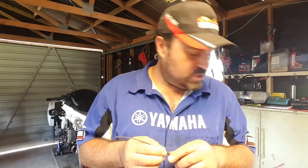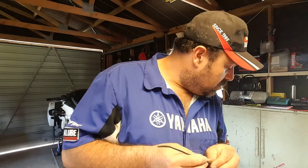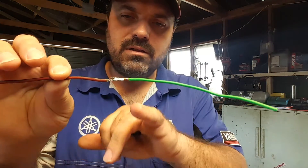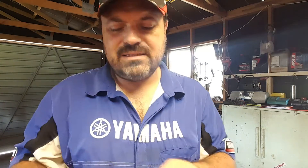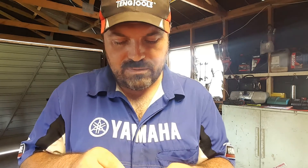This isn't the adhesive stuff — I was given this years ago and there's still quite a lot left. As regards length, you've got the joint in the middle and you need some overlap. You don't want to be right down at the bare minimum — I would say you need at least 10 to 15 millimetres of overlap. The reason is that when this stuff shrinks it doesn't just shrink in diameter, it actually gets slightly shorter as well, and the last thing you want is a tiny gap of exposed wiring where you'd have to add more heat shrink.